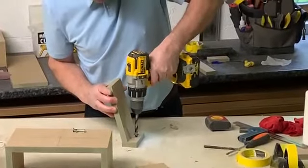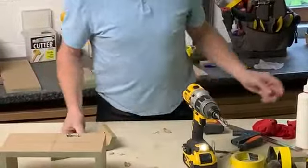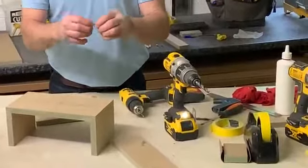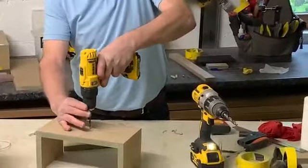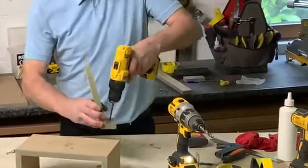So you just jab in the finger there, it's not going too deep. That's okay. Seems perfect. Now, because I drilled the 3mm hole here, it's not going to be big enough for the bar of the bolt. So I need to make that hole a 5mm bit now, right? 5mm. So straight down to there and down to there.